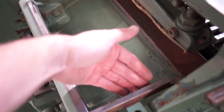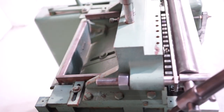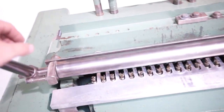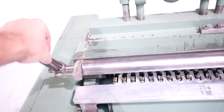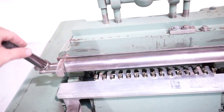You have 15 and a half inches of capacity between your two fences. Remember, you're going to be cutting in pairs — cutting your males and females at the same time. On top of that, you're usually cutting two pairs, utilizing both the left and the right-hand side of the machine.